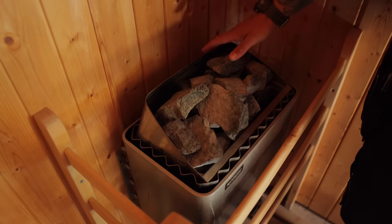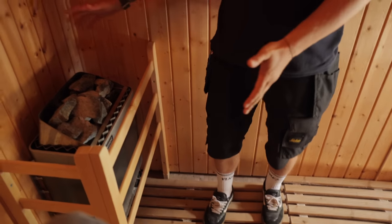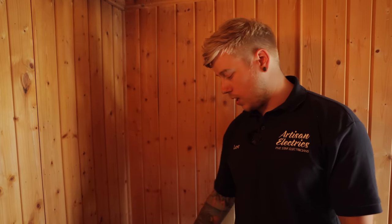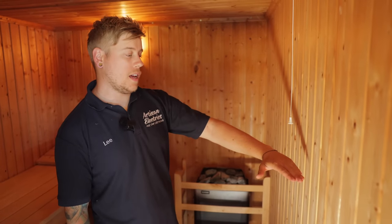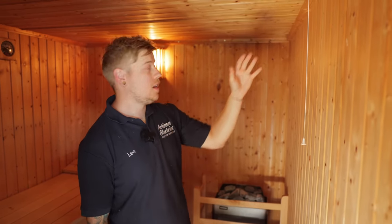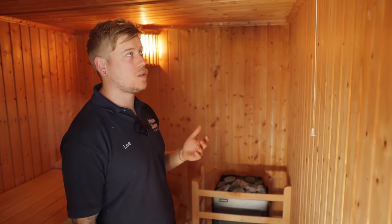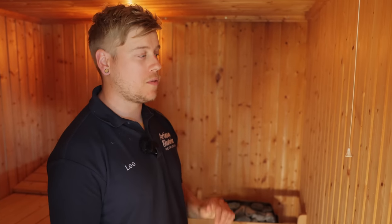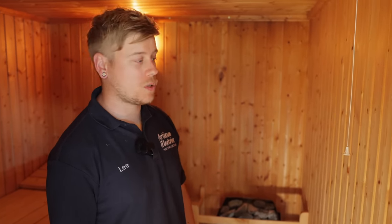We're in a sauna — another special location. This is zone one, and anything half a meter out from here all the way around is also zone one. Zone two is anything past zone one up to a meter high, and anything above that is zone three. Keep electrical equipment as much as possible outside — anything inside such as lights wants to be IPX4, or IPX5 if it's going to be hit by jets of water. Gary from Efix has done a good video on this so we'll put a link below — that's where I scratched up my knowledge a bit since we don't do this every day.